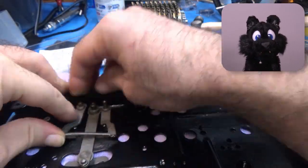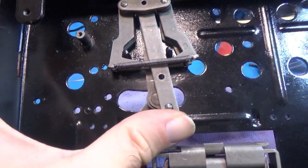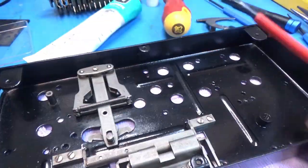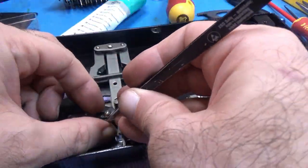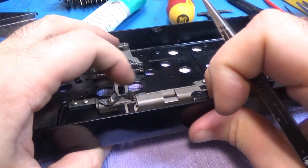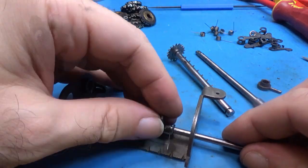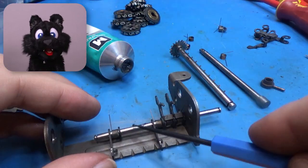There are quite a few springs attached. The lever on the side is supposed to move the carriage to the left or right by one position. I use my usual metal grease for all the slow-moving parts and a dab of oil for the faster-turning wheels and axles because it has less drag.